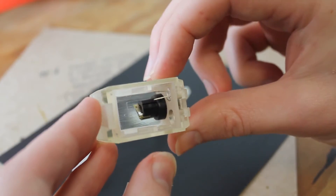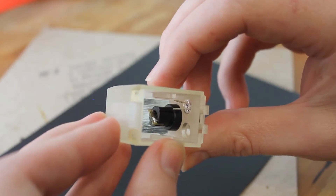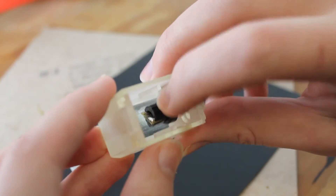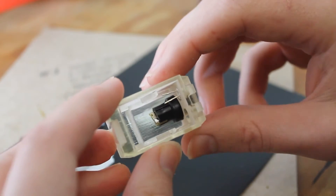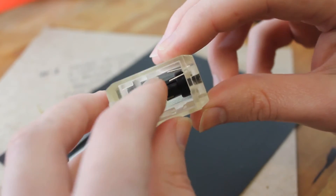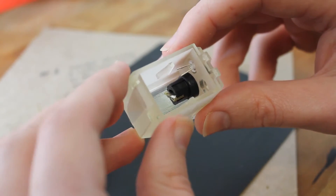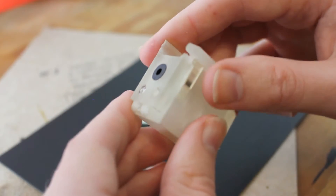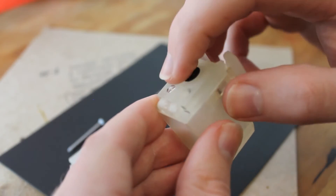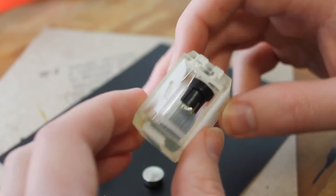This is what the inside looks like — you can see the laser diode sticking out and there's the LED with an additional port for another LED. I was really pleased with the tolerances for the laser diode; they were actually perfect. The LED is alright too, but it doesn't sit flush to the front, so I'm going to tweak that tolerance a little so that it's flush.